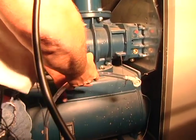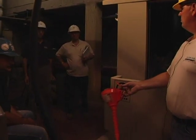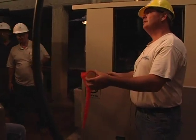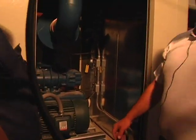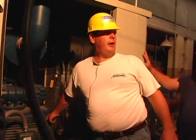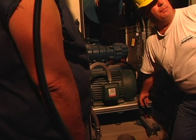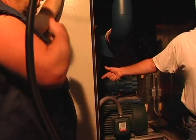This is your discharge silencer — there's really nothing you have to do about that. This is your oil fill — it's pretty handy, actually — with a little strainer. We get to see it from the other side now. Your motor is here. Motor has maintenance points as well: grease fittings on either side. The motor is sitting on the hinge door — that's this piece right here. The hinge door effectively is what keeps your belts tensioned — that's the automatic tensioning device. No belt squealing.